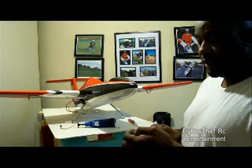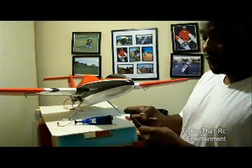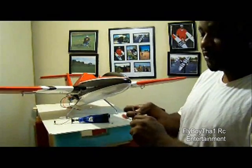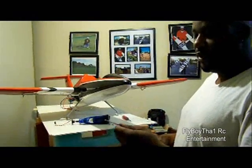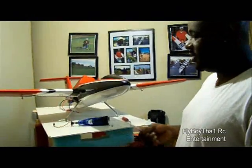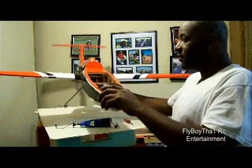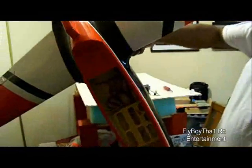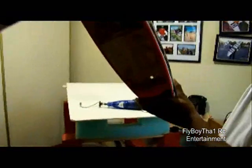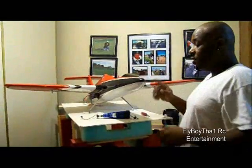So as you just saw, I flattened this out with a Dremel so the screw would hit flat metal there, allowing me — once I screw it in — to not have it go left to right. You really don't want to put Loctite in there; that could be an answer, but if you have to remove this later you're struggling because the area inside there is pretty tight. So I'm going to go ahead and install this nose gear.